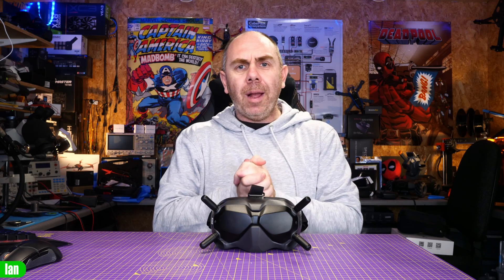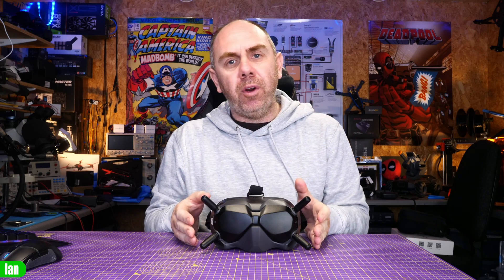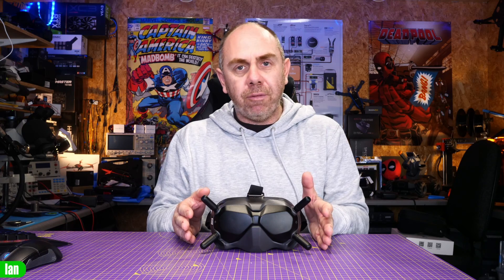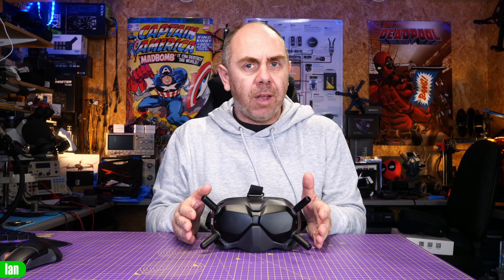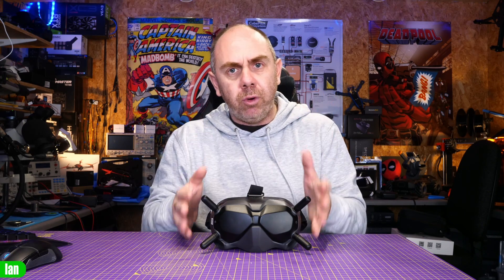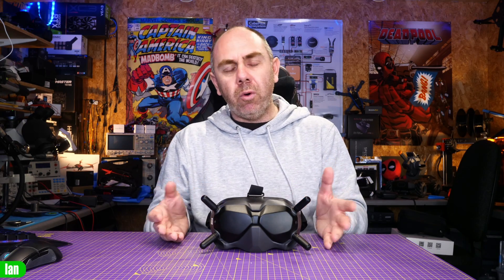The final big question is regarding the V2s and the root hacks — can FPV.WTF be used with the new firmware needed for O3? The answer is yes, however you need to make sure you have rooted the goggles before updating. The situation is the same as with the 0015 firmware: if you root before upgrading, you will still have all of the fpv.wtf OS functionality with the new firmware. However, if you are already on the new firmware, you will not be able to root.